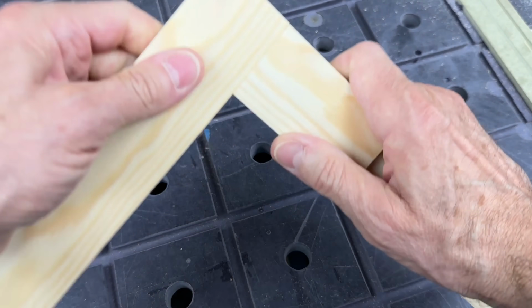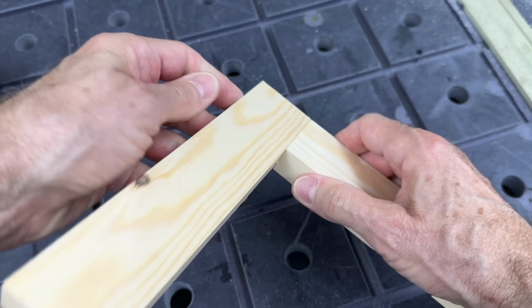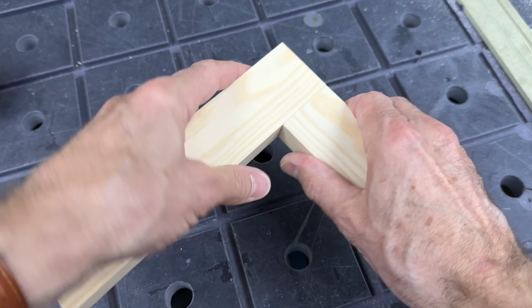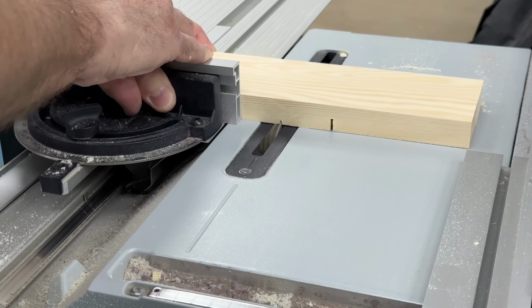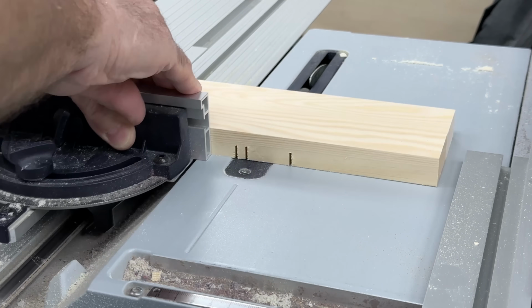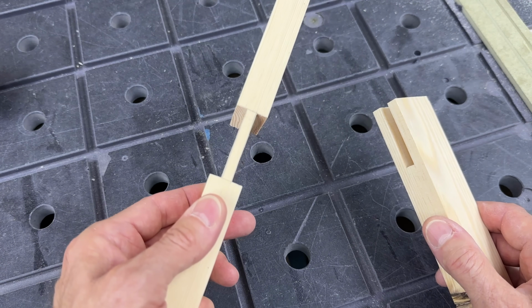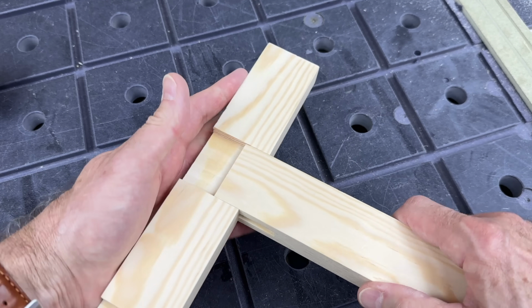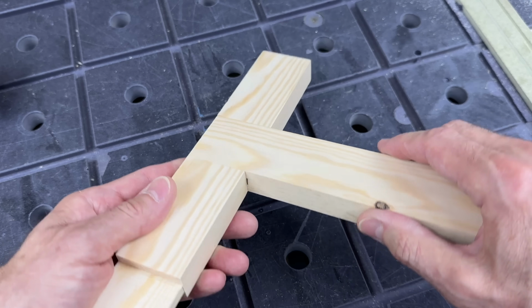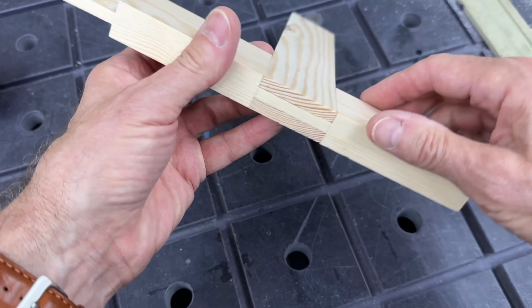That's for the corner or L joint. For a T bridle joint, we do the joint sort of in reverse, with the upright having 2/3 of the material removed and the cross member 1/3 in the center. Again, this makes for a good looking and very strong joint, resistant to racking, with even more gluing area than the corner bridle, but it is a lot more effort though to get the accuracy that you need. But it's an excellent joint to practice your skills on if you need it.